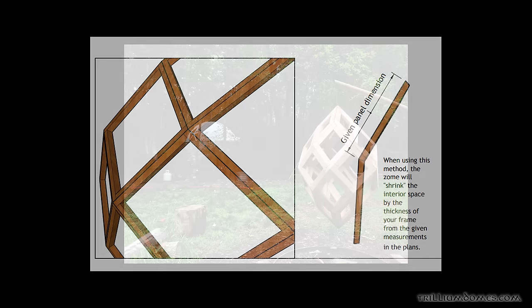The only other angles larger than 45 degrees were for the top panels making up the skylight. I made a jig to cut those without needing the miter saw to go to 60 degrees — I just made another fence 15 degrees off the original fence and set the saw to 45 degrees, so 15 plus 45 equals 60. Since the skylight would have thinner material — polycarbonate at a quarter inch versus three-quarter-inch sheathing — I made those panels out of 2x4s while the others were 2x3s, giving about an inch rise to account for material thickness. For the lower windows I made a little shield shape — any shape works, as long as there's room to flash it properly.